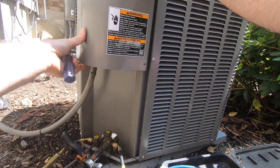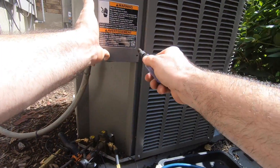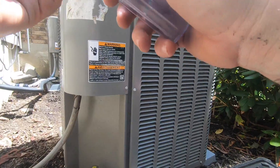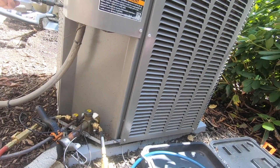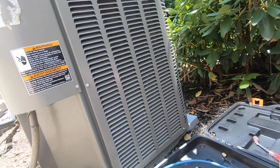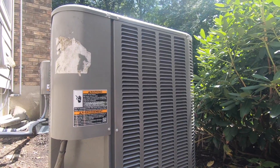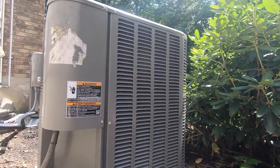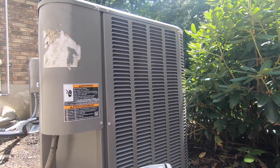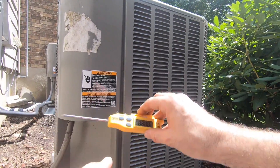I'm going to put the door back on. Okay, we just put the door on and put the nut driver away. And now we are 6.3 on the sub-cool — I think we're perfect now. 7 plus or minus 1, so that's good. 19.8 superheat, 64-degree suction temp. 97 is my liquid line temp. Let's see what the outside temp is.